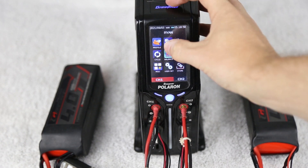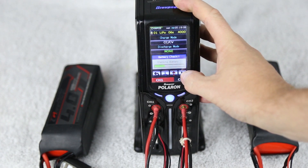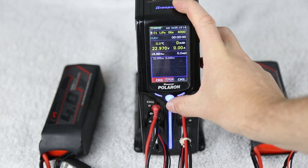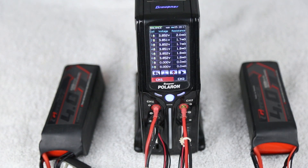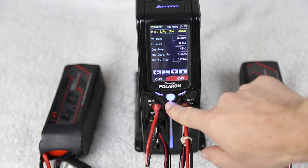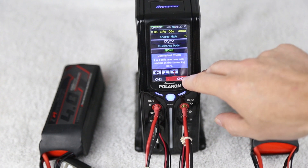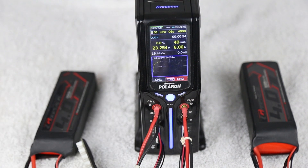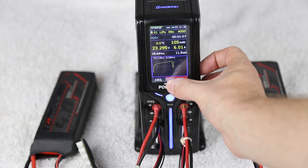Here's the charger. We're going to start initiating our charge here at six amps. We choose six amps as a charge current for our four amp hour battery pack — we talked about setting the standard as long as our charger and battery pack can handle more than a one C charge rate, as covered in the video calculating the true C rating of a LiPo battery. We accelerate the ramp up so you don't need to watch it, and here are the results for our first battery pack. We initiate the second battery so we can identify its average resistance as well.